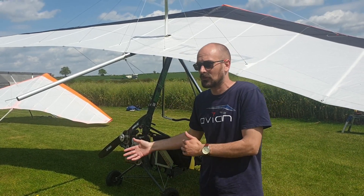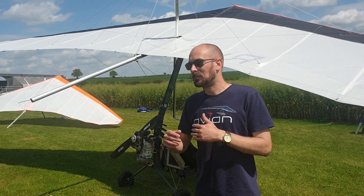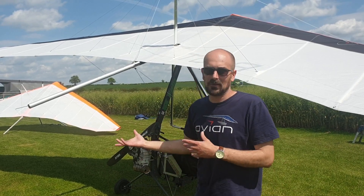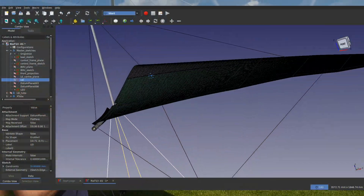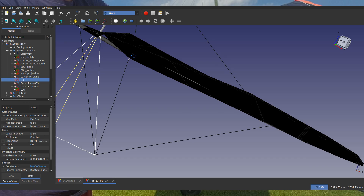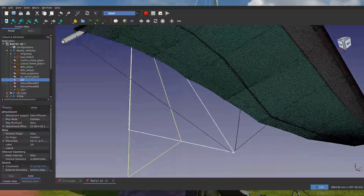Building a wing with a thick wing section is harder than building one with a thin wing section — getting the fabric to hold the shape — and again it's something that would be really difficult without 3D CAD, especially because we've also got complexity in how the under-surface changes its extent along the span. If you come around and look along the wing you can see you've got a sort of semi-elliptical shape, and what this is doing is giving you a more even lift distribution — this actually comes directly from the Puma.